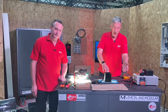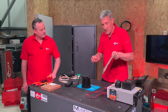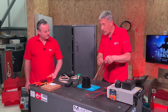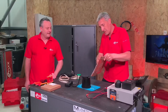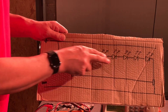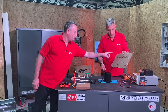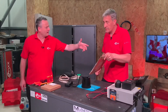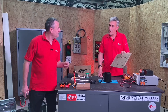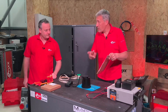So how is that possible? On this strip we have six LEDs in series, plus some componentry with more than two legs on it. What we've got is a linear current regulator that senses the current flowing through that series chain of LEDs and adjusts itself to keep that current constant. So as the voltage changes along the strip, it adjusts itself — almost like a variable resistor — keeping the current constant throughout all six LEDs, and therefore keeping the lux level consistent.